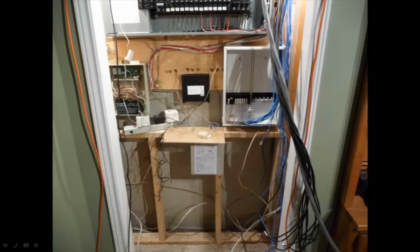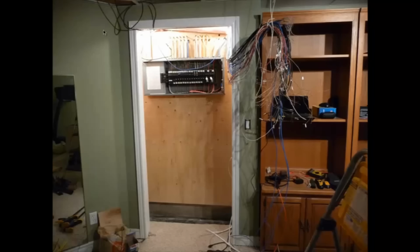And then once I had finished the electrical panel, I removed all the components down here. I removed this half wall over here, and I also cut this bottom portion of this plywood panel off as well, to remove these holes over here, so I could have a nice new piece of plywood there. Now, what they had behind the panel, there were two 2x6s in the back, one over there, one over here. So I just extended those 2x6s down. I basically just added another 2x6 there, another 2x6 there, and I screwed the plywood panel onto that.